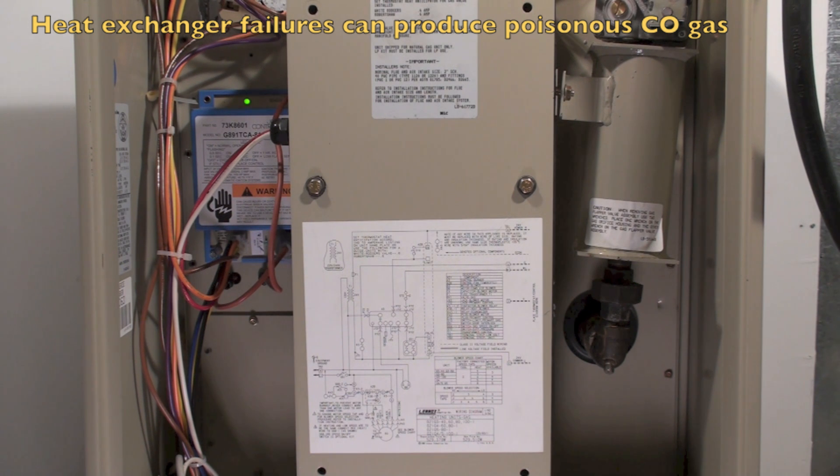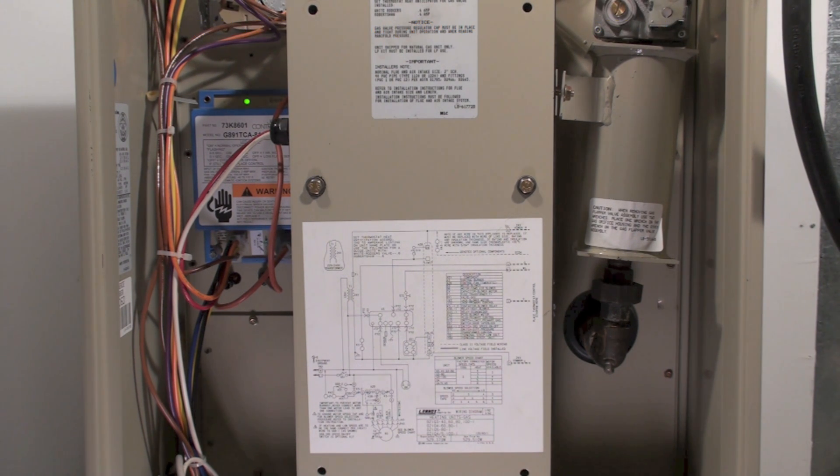That's what you're looking for — you could have a bad heat exchanger when you don't have that smooth ignition. Of course, that's after making sure you've checked the flapper and maybe replaced it, as that could end up being your problem. And that's ignition failure on the pulse furnace.